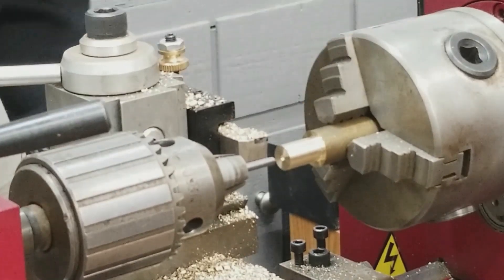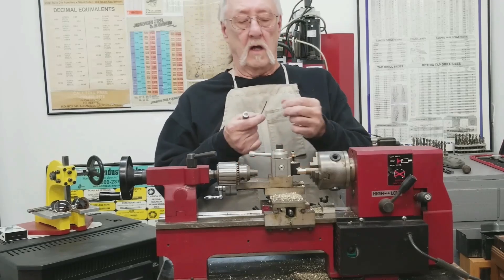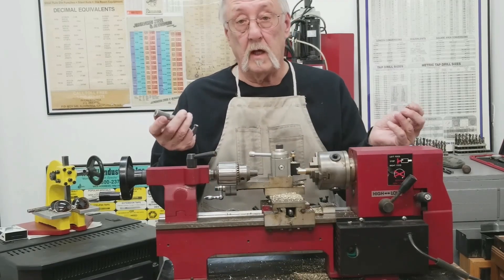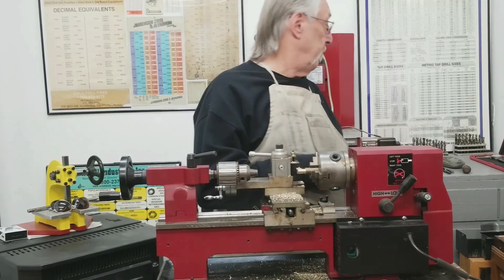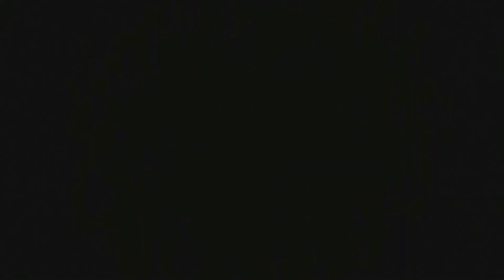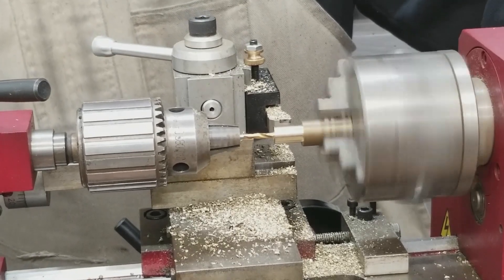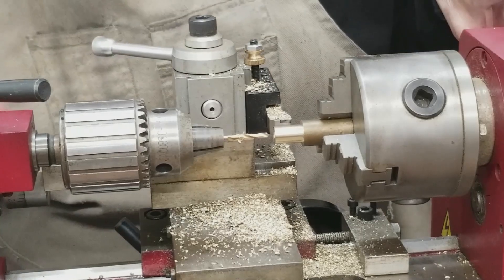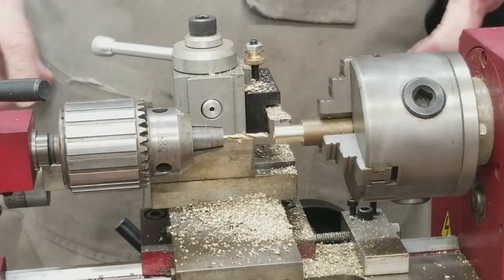Okay, there's a spot. It's a good idea to always measure your drill — I don't care if you got it out of an index, I don't care if it was stenciled on it — because once you drill that hole, if it's too big it's a ruined part. It doesn't take that long to measure your drill bit. 116 — okay, let's drill this thing. I think that's deep enough; the bushing's only going to end up about a quarter inch long.